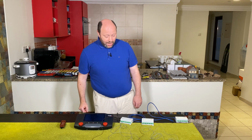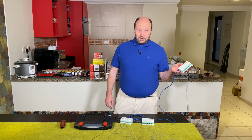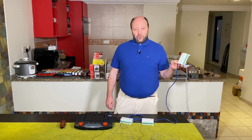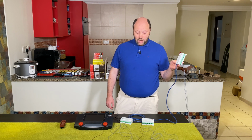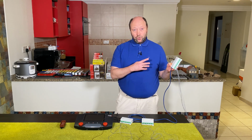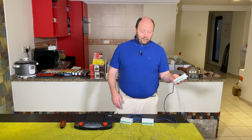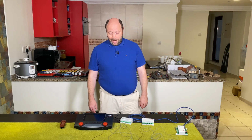The final thing to add is, here I'm only showing the Märklin 60881, which is the S88 AC. There's also the S88 DC, which is the 60882. You can actually mix and match those two devices on bus 1 and 2 as you see fit, which even means that you can have a mixed layout with both DCC and the 3-rail Märklin on the same track.